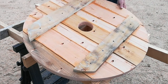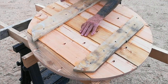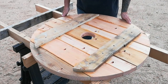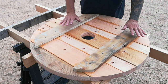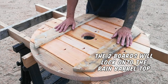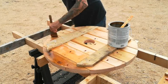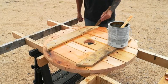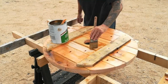Last night before I called it a night, I went back and flipped the tabletop over and filled all the gaps with some exterior-grade wood glue, just to prevent any polyurethane from seeping through. I'm going to put a coat over this entire back side — this is merely to protect it, because it's going to be face down to the water barrel. There might be some splashing up of water, and I just want to make sure that this stays protected.